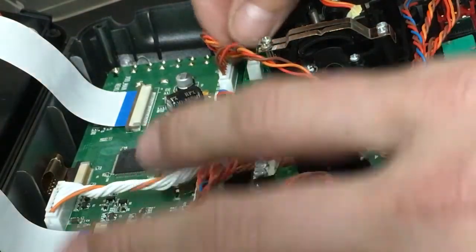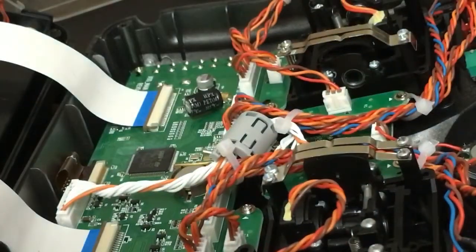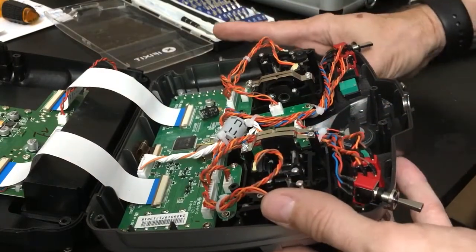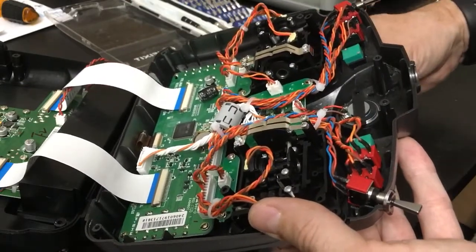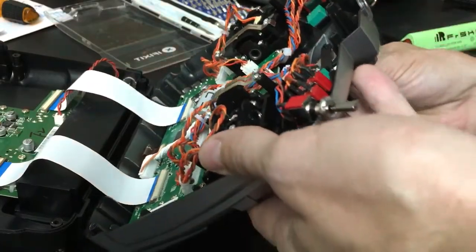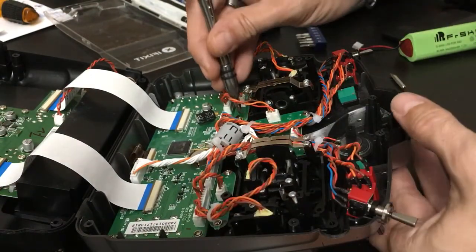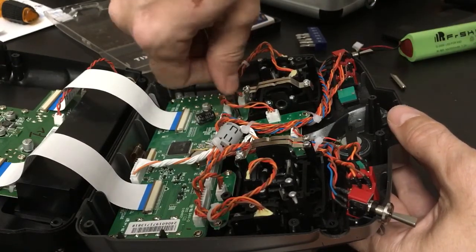So let's go ahead and take a look. This one has the least amount of cord interference with it. I'm not laying these on the sticks, by the way — never lay them on the sticks. Your transceiver will come with these stick protectors. Use these when you're working on your radio — put them under there. It's not just for storage when you store it in the box; it's also very good for using in this particular scenario.